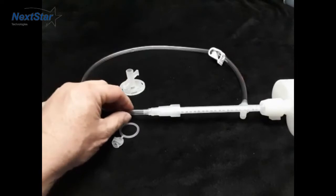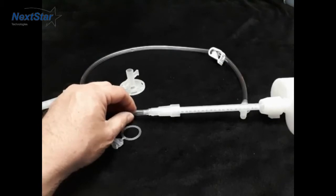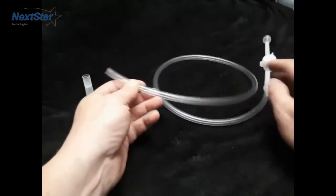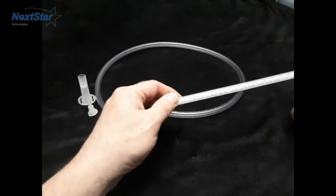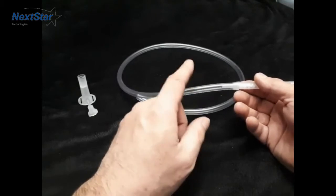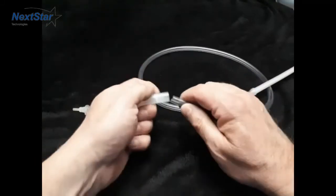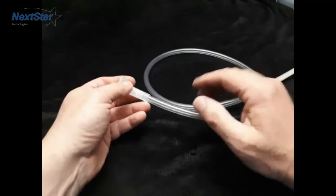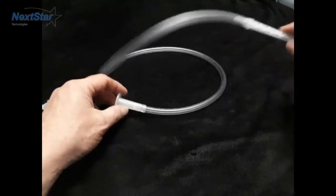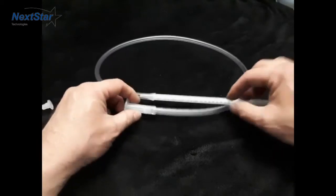If you don't have a feed hose and need to complete a job, here's a homebrew feed hose. This is your standard mixer nut, and this is quarter-inch vinyl hose — three-eighths OD, quarter-inch ID. It happens to fit nicely directly into the ports. You don't have a shutoff valve, but if you've got a location you can't get at and need to make a feed hose, this particular vinyl tubing is available at any hardware store and will get the job done.